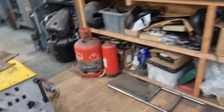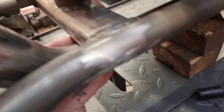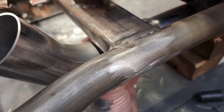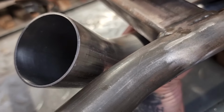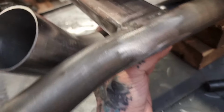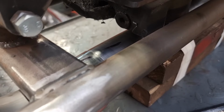Ready to weld up. Then we're going to flash tack it, because we haven't got three hands, so we can't hold that where we need it, which is there, and TIG and feed filler rod and do all of that. So what we have to do is get it as best we can and then get in with the TIG torch, which is up there, and try and flash tack it just to hold it in place a bit, which is the most awkward part of the operation.